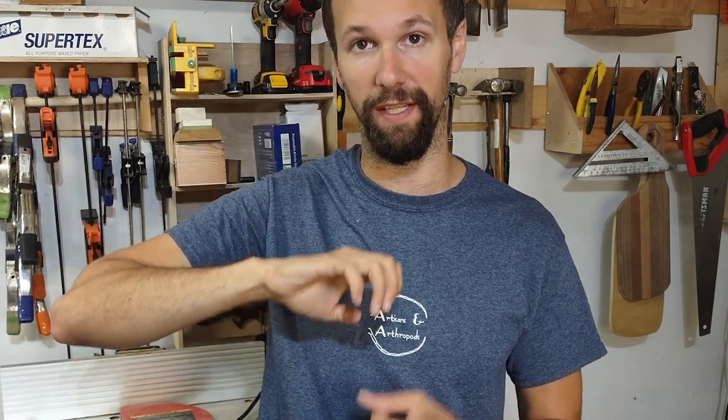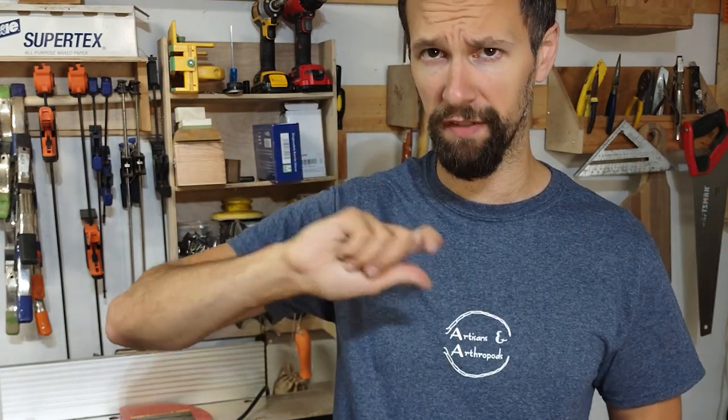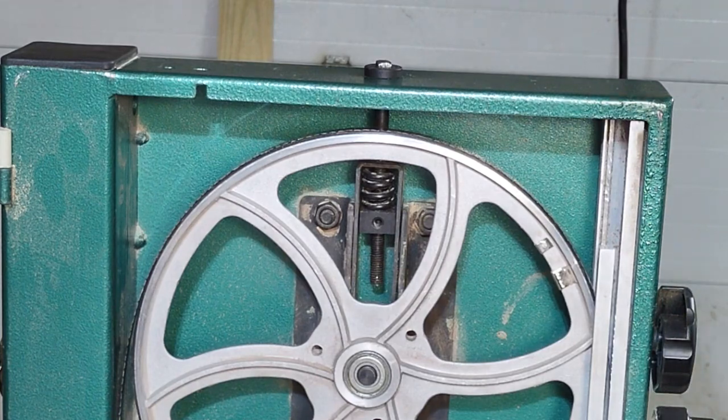We got the new part in the mail. I'm guessing it's just going to break again because there's such a downward force being placed, and that knob is expected to just hold up and prevent that bolt from threading in farther than it should. I didn't feel any resistance that stopped me from turning the knob, so I just kept going. If I had the machine open I may have noticed I was running out of clearance. But again, this all happened trying to tension a blade that the machine said I could use. Moving forward, I think you want to stick in the lower range for blade length — probably a 71.5 inch blade is going to be a lot easier to tension because you just don't need the travel to move the pulley. I would have been happy to do that in the first place if I knew the machine had that limitation.